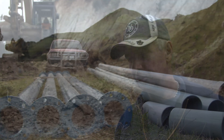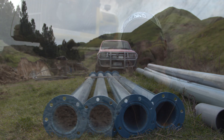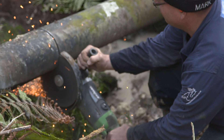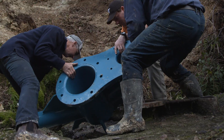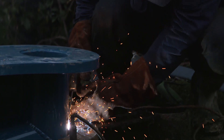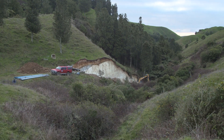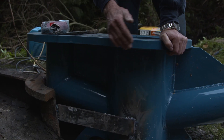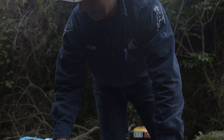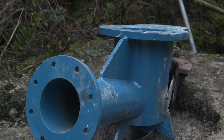What we're doing here is installing a new six inch ram pump, so we're going to take you through step by step on how this is all happening. Mark's just cut the back pipe and cut the bowl in half and the front pipe in half of the existing six inch ram that was here, and as you can see we've just put this in situ.